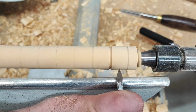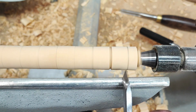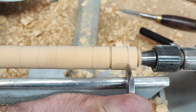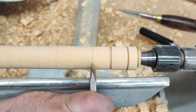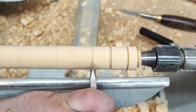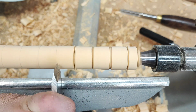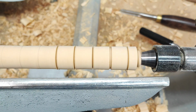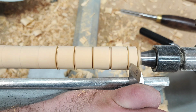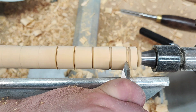So next stuff is to, so I mark another 20 mil distance, so use the long point down to pierce it, and the way you pierce it, you raise the handle just so located where you want to, and just raise the handle, and again here and again, and using the long point down we can make V grooves on one side, another side.